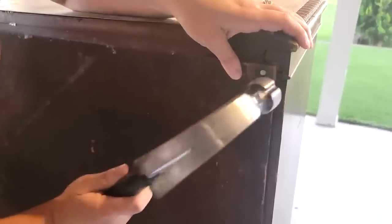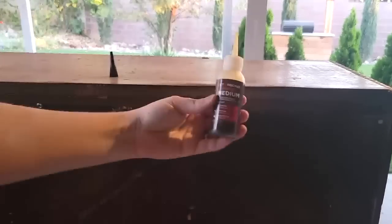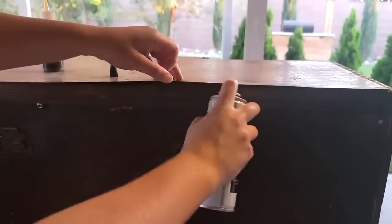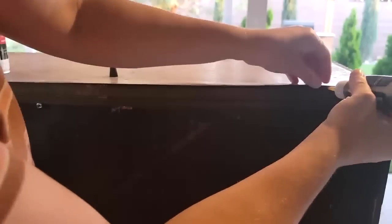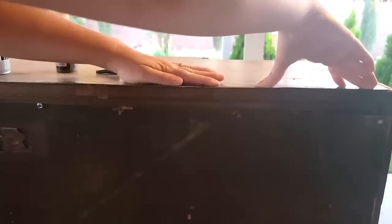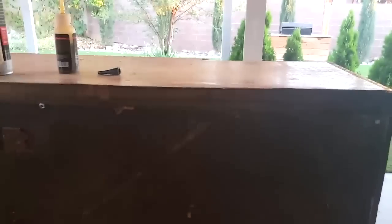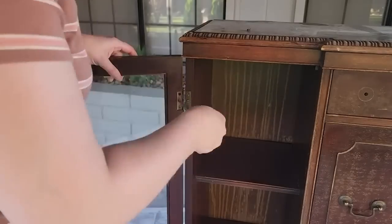You can already tell the condition that this piece was in. It had been left outside — I see this happen all the time. I'm using some super glue to glue back down the veneer since it started lifting because of the weather outdoors, going from hot to cold over and over again. This is why you cannot leave your wood pieces outside. Even in a garage this can happen. If you want to know more about the details of what I'm doing here you can always check out the full length video, and I will have the full length videos of every single one of these projects linked down below in the description box.